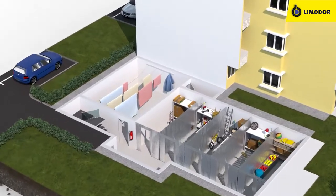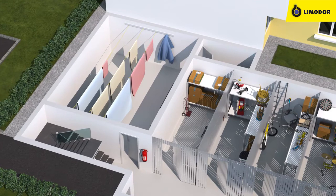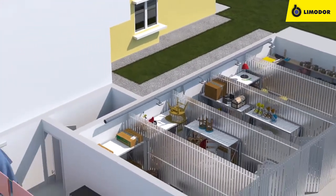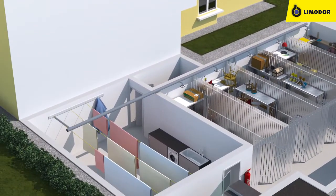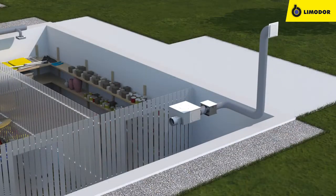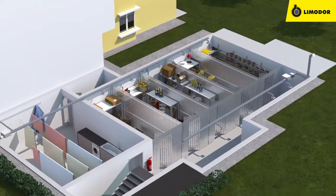Every basement room is potentially at risk for emerging humidity. In this case, the laundry room is the most likely area for humidity. A central ventilation unit effectively exhausts air and extracts humidity from the room via multiple filter trays. To avoid negative air pressure, fresh, dry air is supplied through a filtered pipeline network.